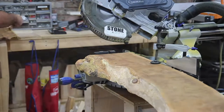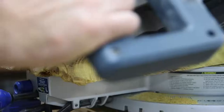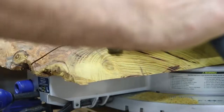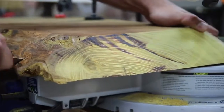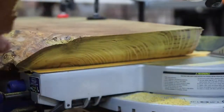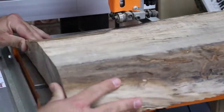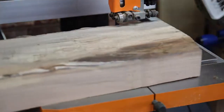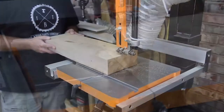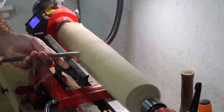The next thing I wanted to think about was how I was going to do the legs. What I settled on was cutting part of the slab off and dropping it down for one of the legs, giving it a mitered corner look. I had to figure out the height of the leg and cut the angles. On the other side I was going to make some hickory splayed legs, so I'm turning those down here to a rough shape.